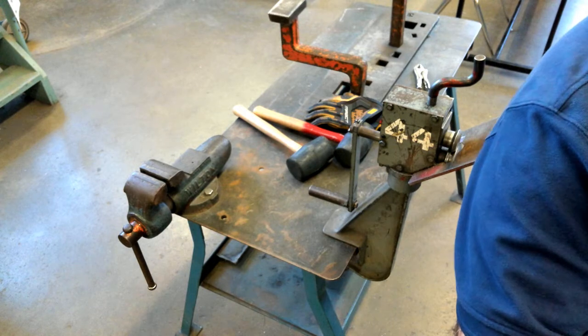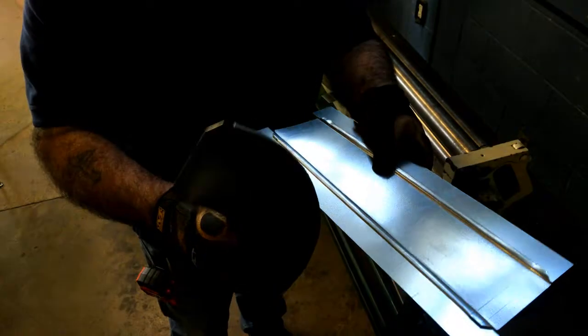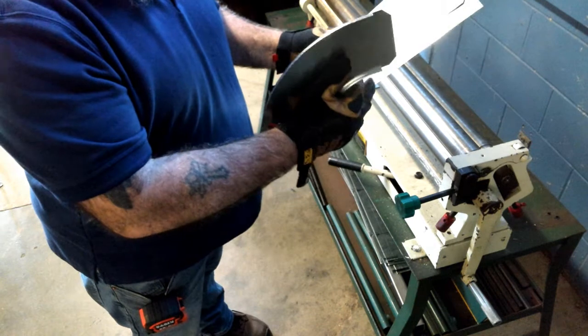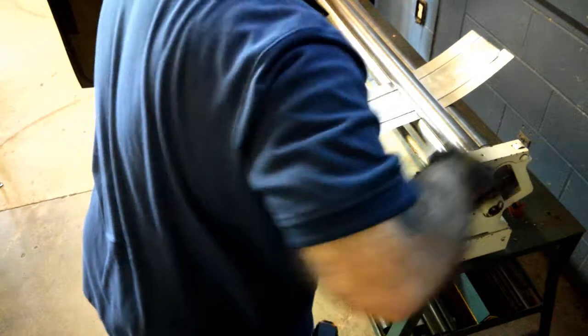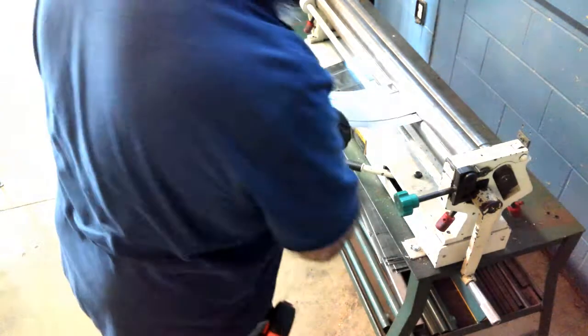Next is rolling my heel and throat on our roll-forming machine. I'm going to use the cheeks to help roll to the right dimension for my heel and throat. I've also taken some scrap of the same thickness — 26 gauge — and put it in the Pittsburgh lock. That's not going to allow the machine to squish it completely together, so I still have space to get my flange in there. I'm sacrificing a piece of scrap, same thickness, to take up the space that will be my flange. We've adjusted our machine, starting with the heel — I'm going to roll, flip my piece, and roll again.